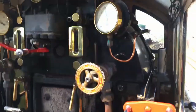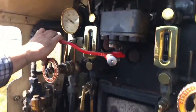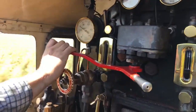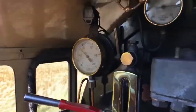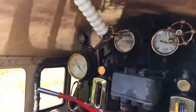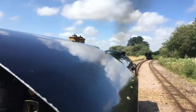It's just turned off the steam injector — there's enough water in the boiler now. We've got about 60 pounds per square inch on the steam chest pressure gauge. That tells you how hard the engine's working. A little bit more now as Steve's opened the regulator a bit. You can hear it in the exhaust — it's working harder again now.